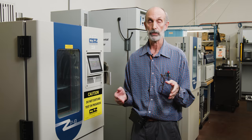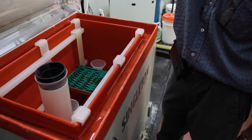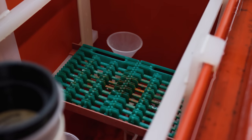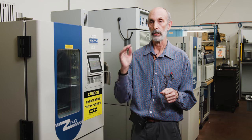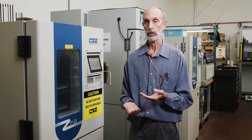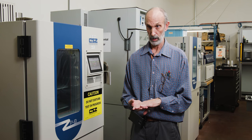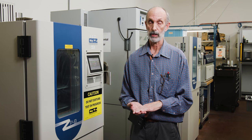The next test is a high humidity environment for an 11-day period — a rolling cycle with 95% humidity and alternating temperatures between 30 and 60 degrees. After that, they go into a rainfall test, which is an IPX4 test. After they pass that, they go into another immersion test at IPX7. We also do a drop test according to ANSI FL-1, where flashlights are taken and dropped on six sides, and then beyond what ANSI requires, we do another set of those drops.